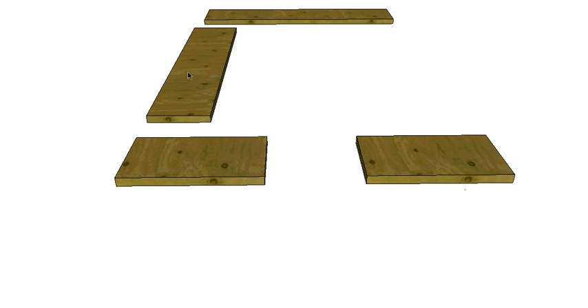On the ground we put down what we call sole plates, or sole boards — basically just a timber board that the rest of the scaffold sits on. It helps distribute the weight of the scaffold across the ground. When I originally did my scaffolding course we were taught to use one sole plate under each leg, however WorkCover — the WHS authority in New South Wales, Australia — wanted the sole plates to extend across the full width of the scaffold. That's how I do it now. The sole plates sit on the dirt to level the ground and give you a firm base.